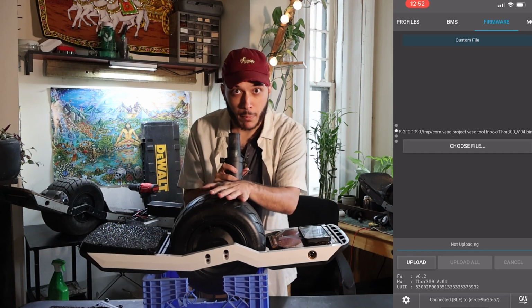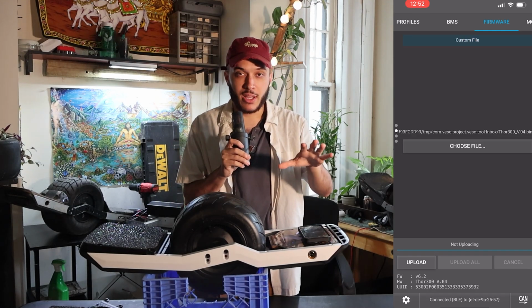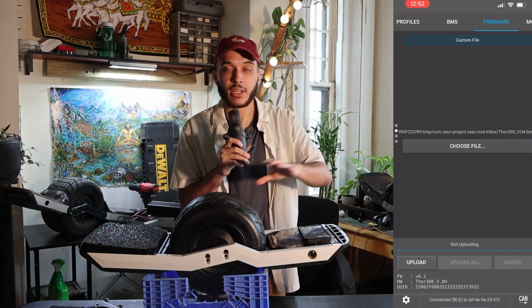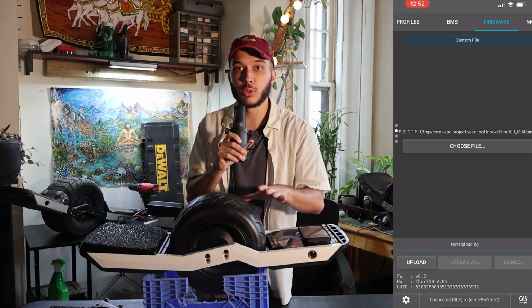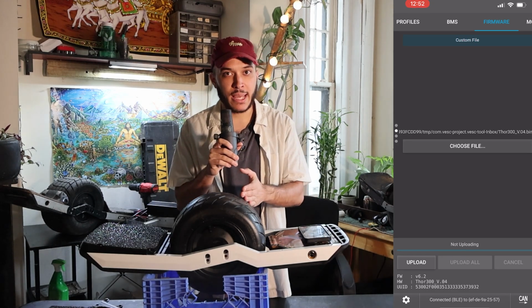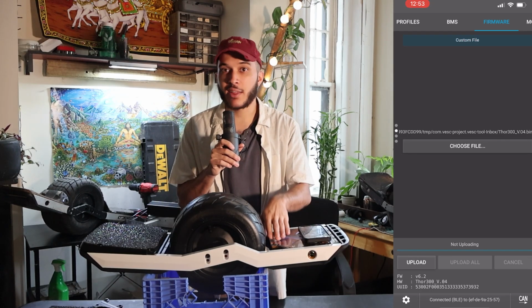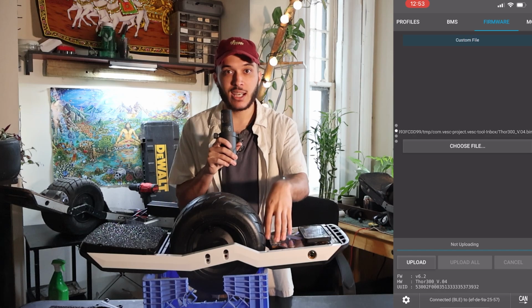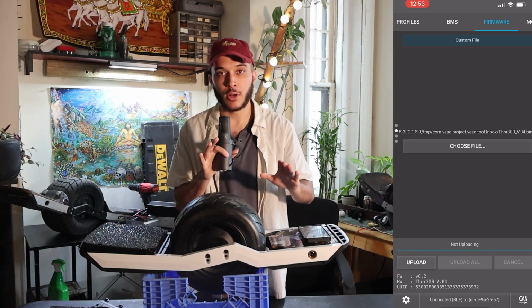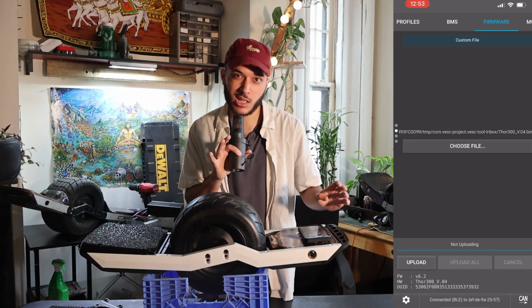Now, right before we press upload, pause for 1 second. Make sure that your phone is next to your controller and that nothing else is happening on your phone. We don't want the Bluetooth connection to be disrupted here. If it gets disrupted, or if it disconnects, or if anything weird were to happen, it could brick your Thor, and you'd either have to get a new one or get an ST link and then reflash it. A bunch of work we don't want to have to do. So make sure your connection is nice and good and keep it right here. Keep it nice and simple.